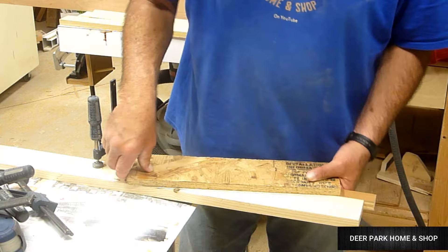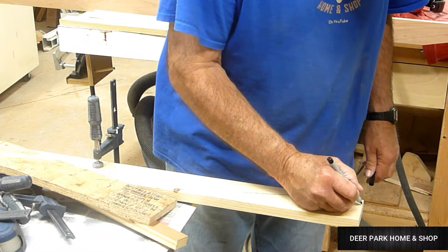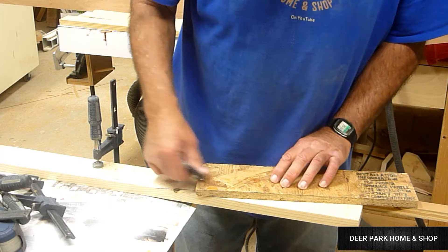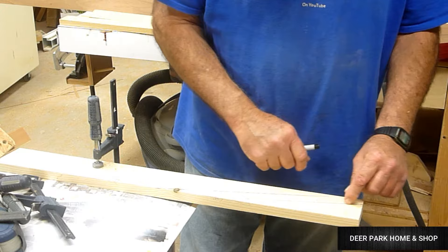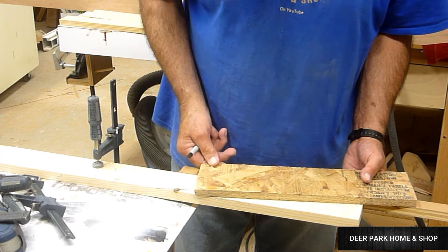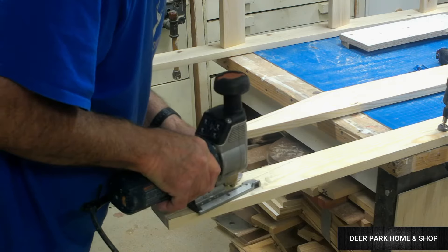Notice that as I move down the board, that angle moves with me. So what we'll do is put a nub about right here — I'm just eyeballing this, it doesn't have to be perfect, but I'll terminate my next line there. I'd recommend against using a marker; I'm doing that so you can see it in the video. Notice that even the edge of the board rides with me, so I can draw a line here going all the way off the board — that's where we're going to cut. I'm going to take a saw and cut about an eighth inch outside this line, then reinstall our jig and take a piloted router bit and route that off smooth. I've made several of these jigs for different ladders and you will see a different one used later in this video, but the functionality will be just the same. You only have to make this one jig for this project.